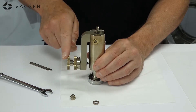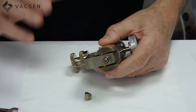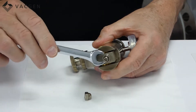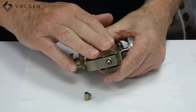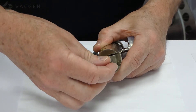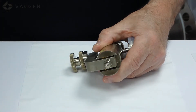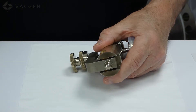So you may have to repeat this exercise a few times until it is actually there. With the valve fully set, the first thing you do is put the washer on, put the nut on and just lock it off. It is best just to try and leak check it once you do that just in case you have moved it. Then put the dome nut onto the top, do it up, and that is now a working valve.